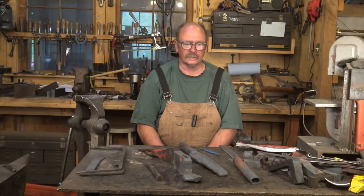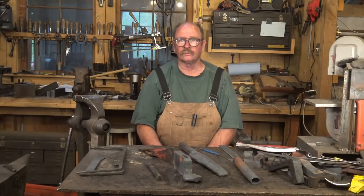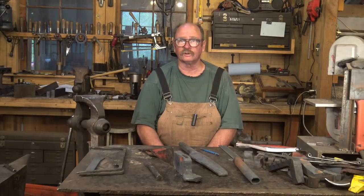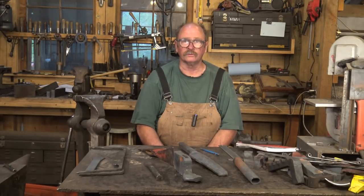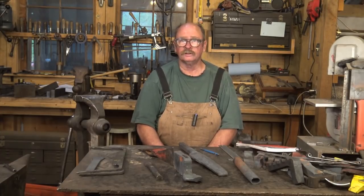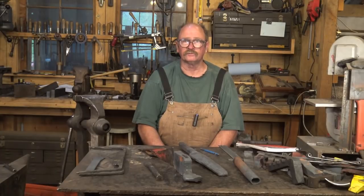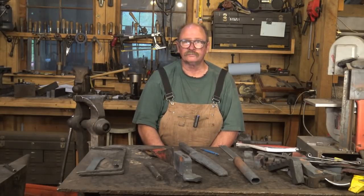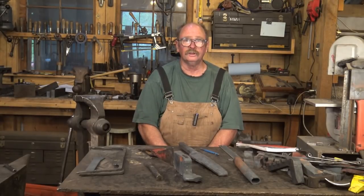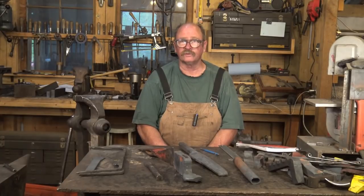These little hammers are really quite fun to make — they're nice simple projects and not anywhere near as hard to do as a two or three pound forging hammer might be. This one will probably end up weighing about 12 ounces, maybe a little bit more. They're a fun little project; you can make them for lots of different purposes. They don't get a lot of use in the blacksmith shop but they could. They're very handy in the wood shop or if you've got a craft shop, do a little leather work and set copper rivets — which is what this one will probably be used for. These sell fairly well at the woodworking shows that I go to.